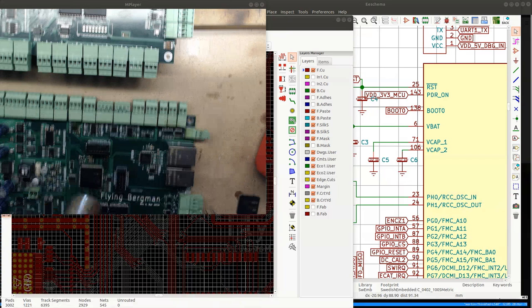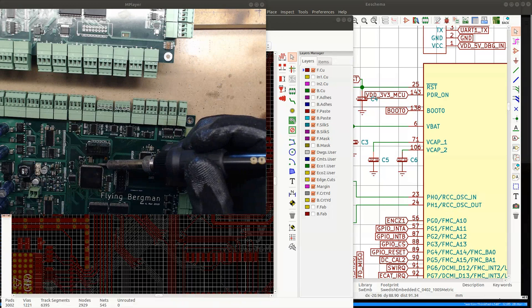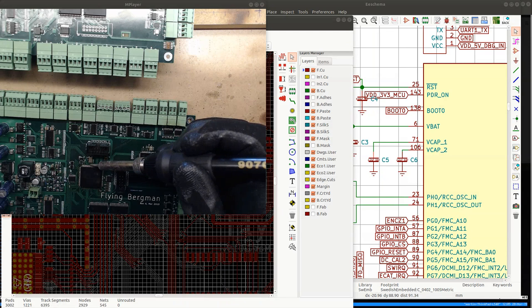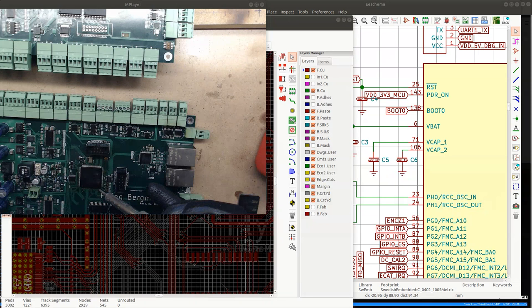Okay. And it's time to just go over the pins and make sure that they're all connected. Some pins on this chip are slightly bent after wicking them too much. Hopefully I won't have any short on the bent pins. The pin that is bent is the boot pin, so having that shorted doesn't really help much in getting the chip to work. It needs to be working properly.